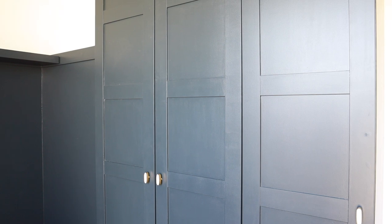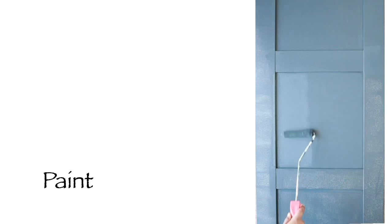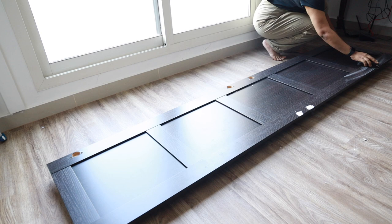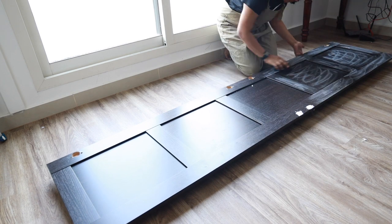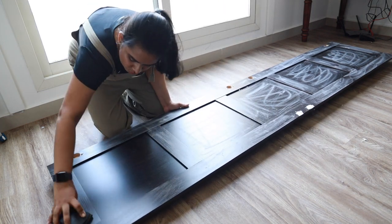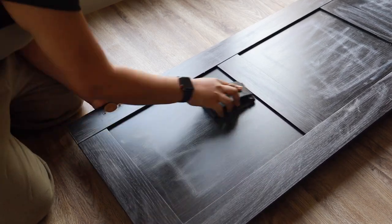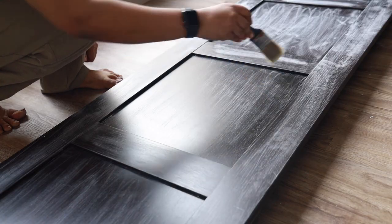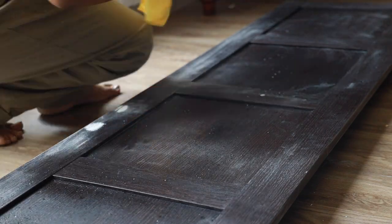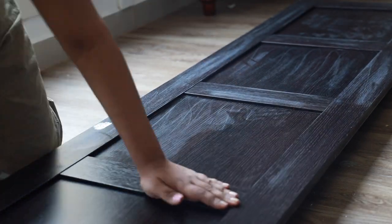When it comes to painting a piece of furniture, I always follow three steps: prep, prime, and paint. I started prepping the door by filling the holes left by the door handles, and did a light sanding because IKEA furniture comes with a glossy finish which makes it harder for the paint to adhere. A light sanding gives the primer and paint something to hold onto. It's also very important to clean it with a degreaser to remove any dust, grease, or oily substances.